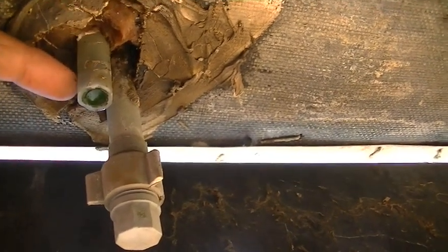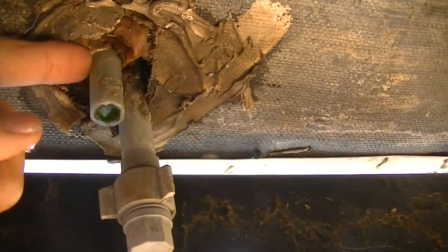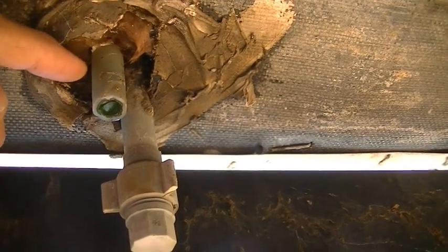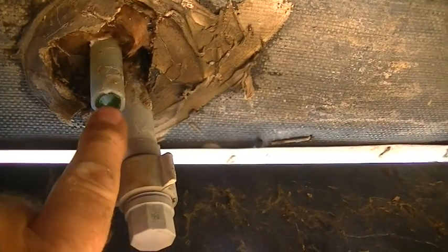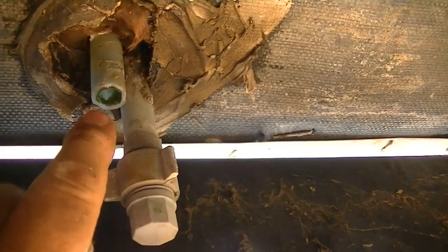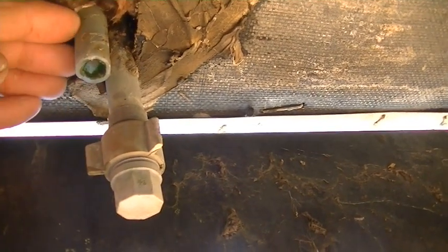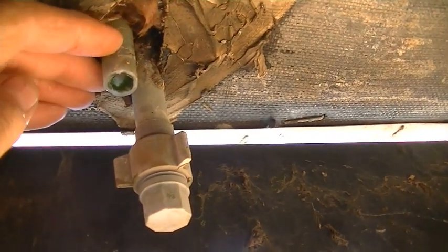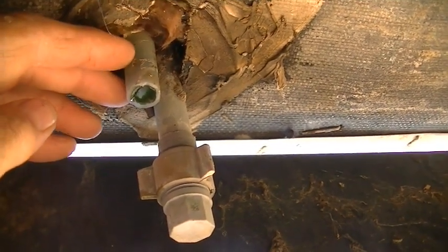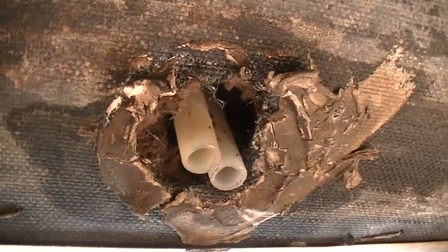They are more expensive but easy to use. What we have to do is cut this off clean, then steel wool the outside very lightly — don't take off material, just get rid of debris buildup. Also, the inside of the line has a lot of green algae and buildup that has to be cleaned out, because a SharkBite inserts inside the pipe and makes an outside connection as well, so both the inside and outside have to be clean.